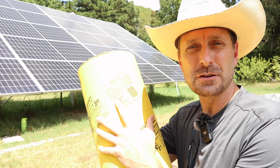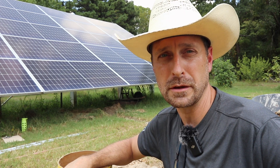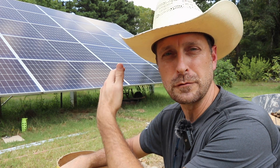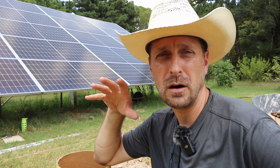Today we're going to be using these 8-inch sonotubes, and these are going down about three feet into the ground. That's a little bit less concrete than the instructions call for, but I'm okay with that. I understand from my profession that things are usually over-engineered by about 200% for a safety factor. I've just got four panels in front of my big mount, and the uplift on it from any wind is really not going to be that much. That's because I don't live in a windy area at all.